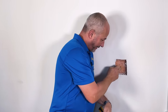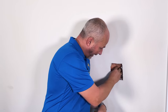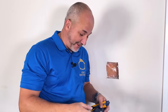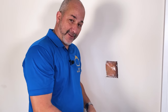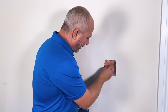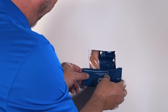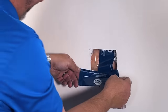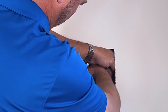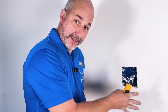Just a quick note: this is an exterior wall, and in Canada we have a four-season climate. We've been using vapor barrier plastic on exterior walls since about the mid-1970s. Because we used the saw, we've now compromised it. You really want to make sure you protect against warm air meeting a colder space inside the wall, because that'll drive condensation which will lead to ice build-up. Step one is done — the insulation and vapor barrier are taken care of.